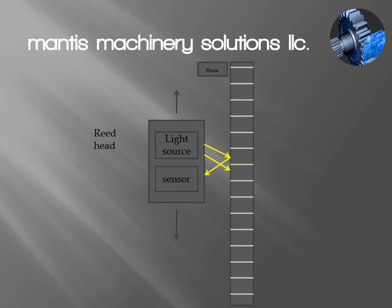So far we know how far we've gone and in which direction, but we don't know the reference point yet. That is accomplished by a home switch. Along one end of the axis — the negative end — is going to be some sort of sensor, whether it's a proximity sensor, a limit switch, or it's even built into the encoder. When the axes are turned on and referenced, they move in a specific direction, recognize that home switch, and call that the zero point. From there, the machine can easily determine where everything is on the table.